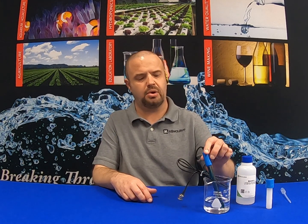To get started you will need to use Milwaukee Instruments MA-9015 storage solution. We recommend taking a small container and putting a minimum of two inches of solution in it, placing the probe down for a minimum of two hours prior to hooking up to your meter for calibration. We call this hydrating and conditioning the probe.